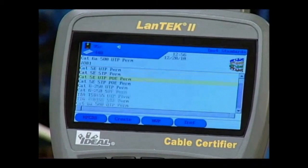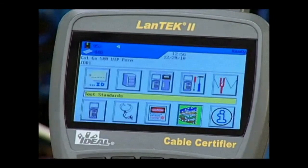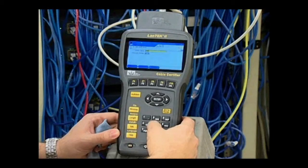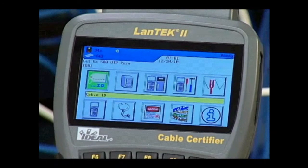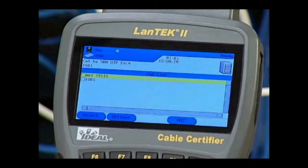Return to the Ready screen and press Enter to select Setup Cable ID. Make sure Single Cable ID is selected and then choose Set Cable ID by pressing Enter. Enter the cable name, then press the down arrow to input the current value. Next, we'll set up a folder to store the test results by highlighting the file icon and pressing Enter. The job list displays all the existing folders currently stored in the tester. Press the Options Function key and then select New Job from the list and press Enter. Create a job name that is relevant to the job at hand using the keypad and press Enter.